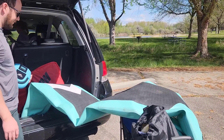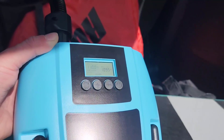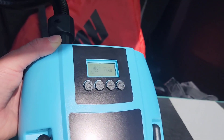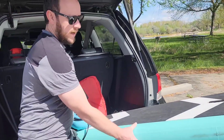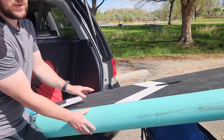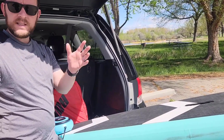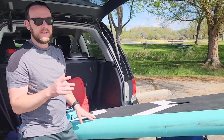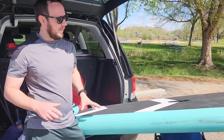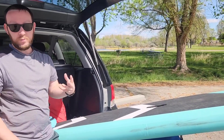Let's just go ahead and watch it inflate. I moved it down to 11 PSI for the video because that actually feels quite firm to me — I don't think I need it any more than that. That took about six minutes to inflate it. It did show two different stages: the initial stage for the first one to two PSI is a high flow to really fill up the volume quickly, and then once it gets filled up, it changes to a second stage to go against a much greater pressure.